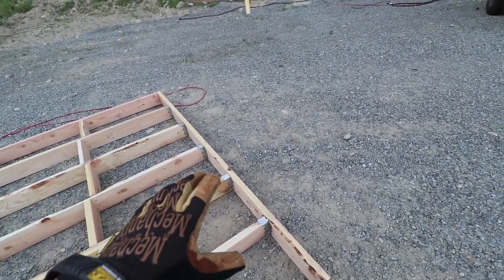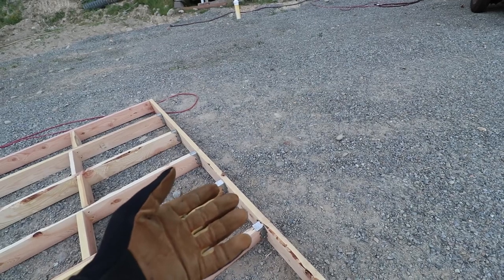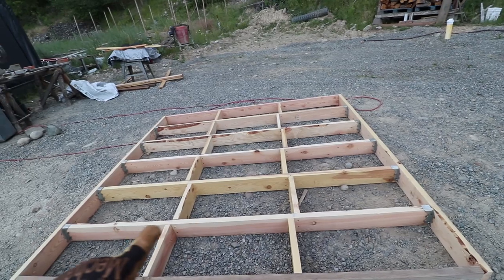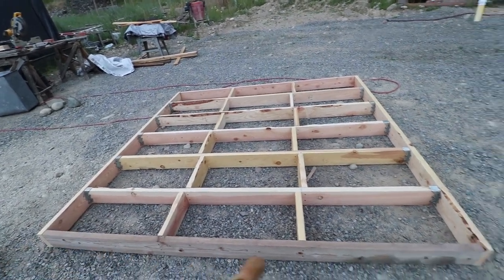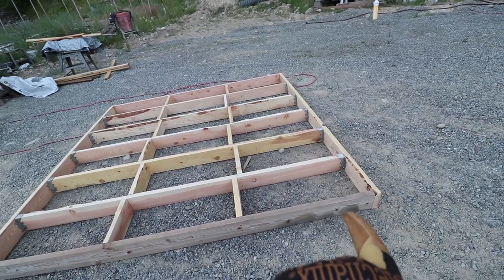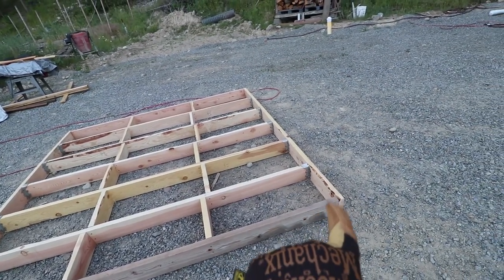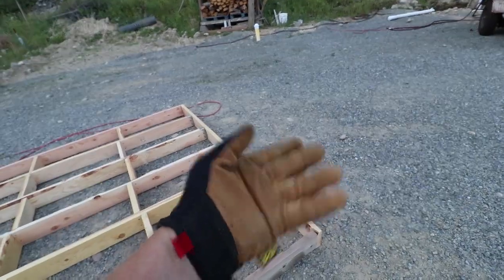So the rock accumulates on the bottom, and then you go to lift the Grizzly out and it yanks this bottom board off. And I think the problem there is that we're using the shear strength of fasteners wrong. So I'm thinking now that this will be up and down, and this will be more like a purlin system. So when the rocks come rolling down, they're not going to knock this board off because it's nailed in from the ends. And I'm thinking about putting some strapping around the ends there. And I talked about doing some triangulation here too, that should really strengthen this board. And in order to knock this board off, you'd have to shear the nails or pop the nails out here, which is far less likely than if you just pop the nails out the end, just like that.